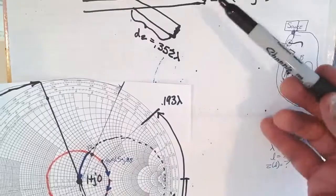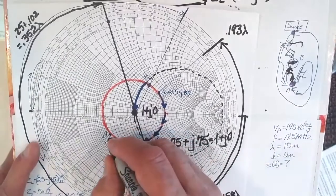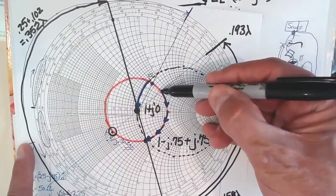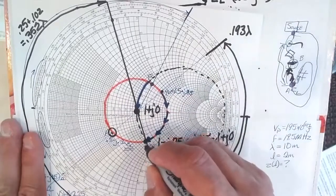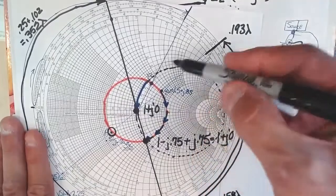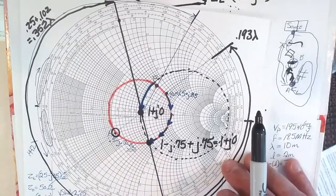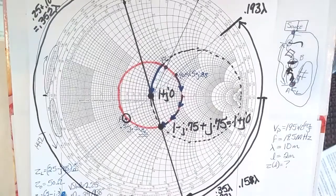So those are the 2 lengths that you would have if you were parallel stub matching. Remember, step 1, find small z sub L and plot it. Step 2, since you're parallel stub matching, find the admittance, right? Once you found the admittance, then you want to follow it around until you hit the R equals 1 circle. And that's this black circle here, not the red one. The red one is the constant VSWR circle, of 2 point, whatever I came to, 2.25. And you can read that right off the bottom here. So I hope everybody has gotten these two things.